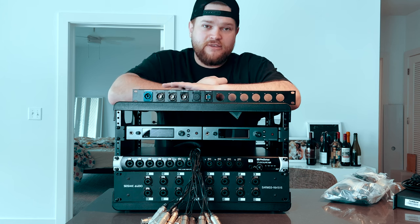The last thing I need to talk about before the montage are these right-angle XLR adapters. Everything on the front here — on this bottom panel and on the StudioLive — needs to go in at a right angle instead of straight. Straight connectors will not let the case close. So I'm going to start wiring things up and soldering, and I'll check back in when there are things I feel are important to know.